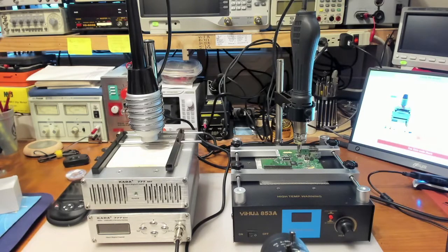And quite often you will see that they'll have to put flux around these things, and they will blow hot air on it. The flux is just blown away. Nearby little capacitors or so on, SMD capacitors, might get blown off the board. And this is where these kind of workstations come in.